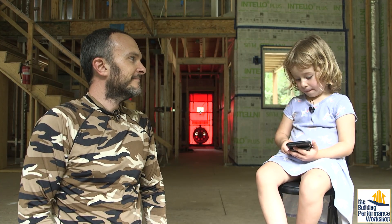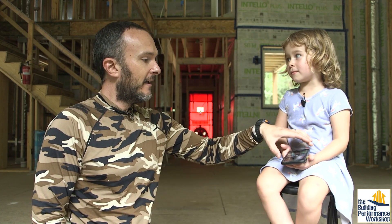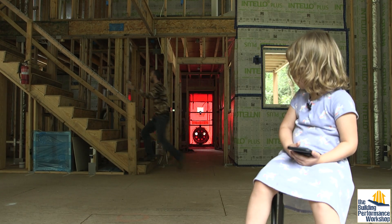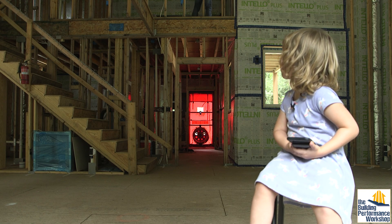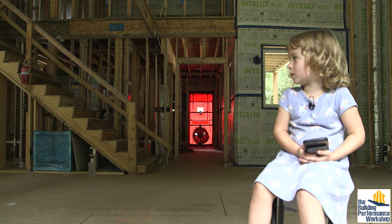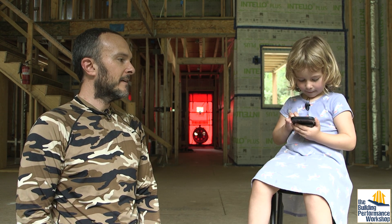This is again before drywall even adds that air tightness layer. Okay Nanette, fire away. So we're driving up towards 50 pascals, which is the same pressure we take every house in the country to. Hang on a second, there's something wrong — there must be a door open. Yep, door's open. Clever girl, I saw that too. I'll pay better attention next time. Take us to 50 pascals please. Five, zero, then green.